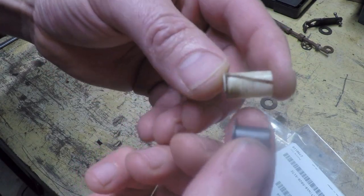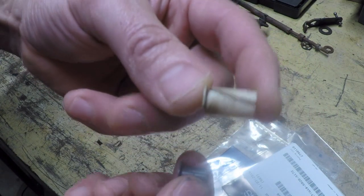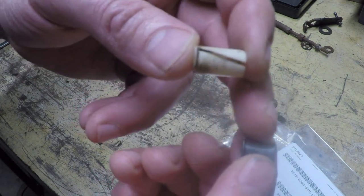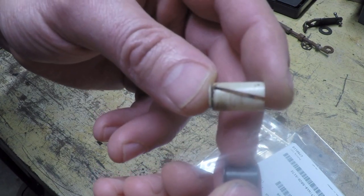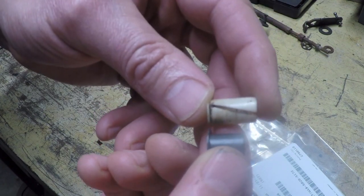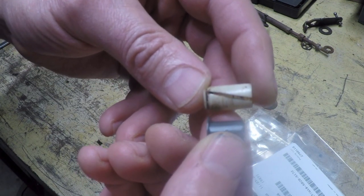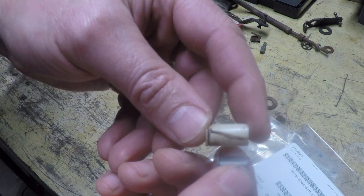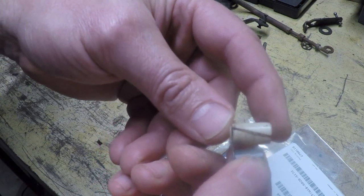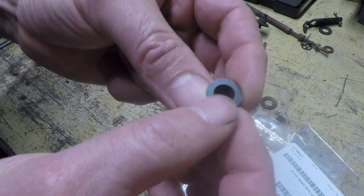Dimensionally they're almost identical, except these sleeves are 5/8 inch long and these are half inch. I could have gone with half inch or three-quarters. This is actually a little bit shorter — I opted for the shorter because I was worried the longer would give me a problem. I think the little bit shorter is going to be fine, especially since I think this is going to be a superior material. This is designed to run completely dry without lubrication, it's dirt resistant — I believe this is their G300 series material.